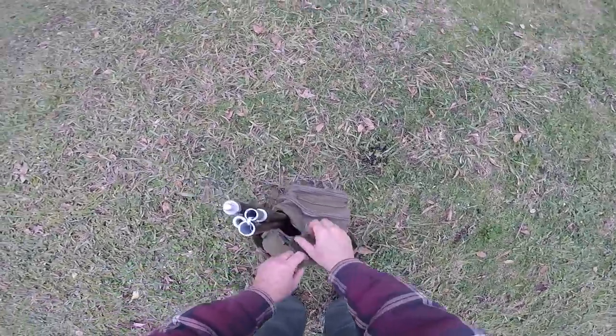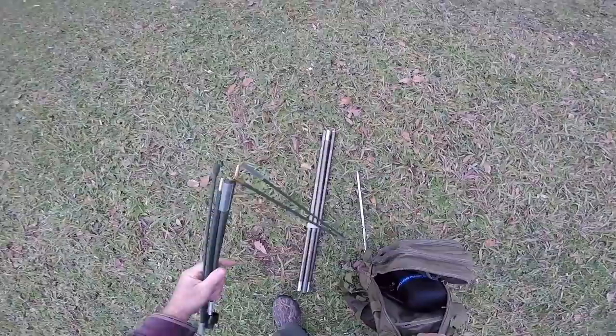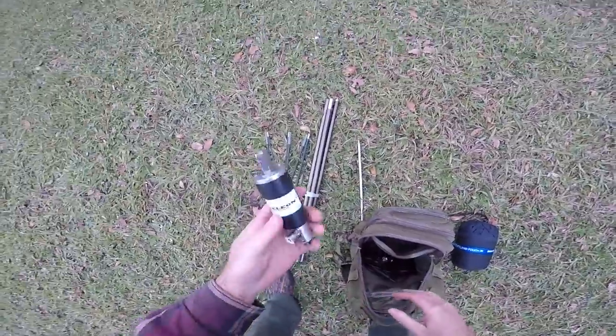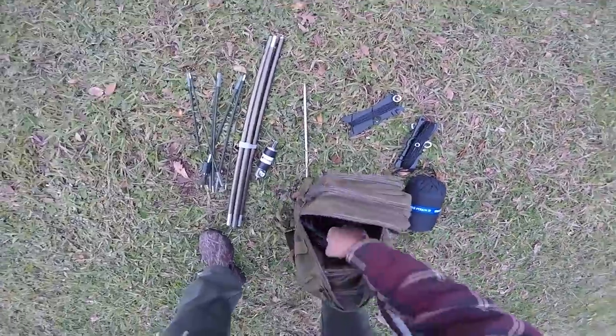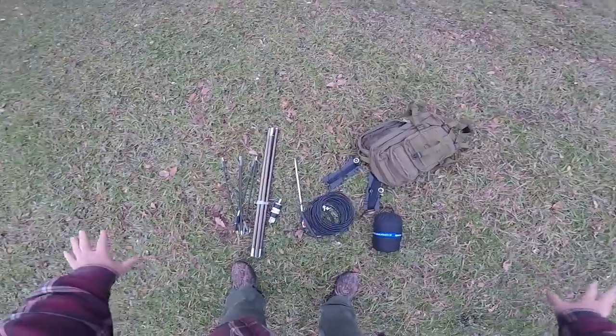Let's go take a look at the M-Pass in the wild. Let's say you're at the top of a mountain or the top of something and there are no trees to hang an antenna anywhere near you. Well, this is a vertical — it's a 20-foot vertical. You can, in 10-foot sections, basically make it a 10-foot vertical. I'm gonna set this thing up two different ways: as a vertical, like here.